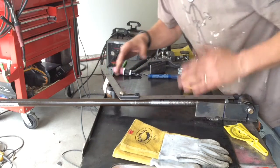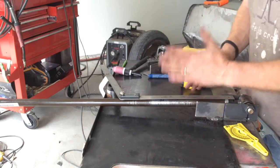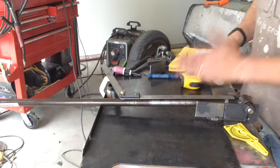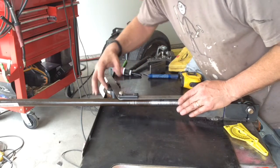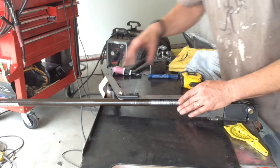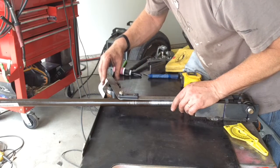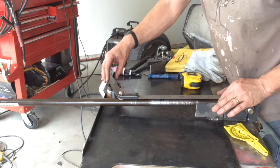Like I said, one thing you've got to watch when you start measuring for bends is to always work from one side of the tubing or the center of the tubing. Don't switch back and forth. I'm going to work from the side of the tubing closest to the camera, and I know I want my tube notched fully in by the time I get up here, right at that halfway point. So I can line this up with the tubing, line up my angle where I want it, and I know that's the outside of the bend all the way around.